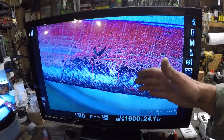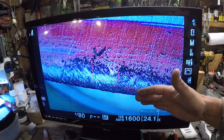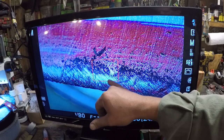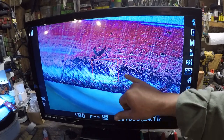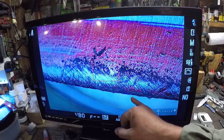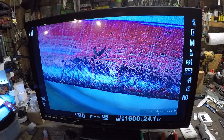Now, that'll let you know either to adjust your edge angle a little bit if you want to, or just to keep right on going, all right? Once you see with the naked eye that all of this ink is gone from the transition zone to the edge, if you haven't brought up a burr already, you're really, really close. So just keep on going, okay? So, like I said, like on this knife right here,